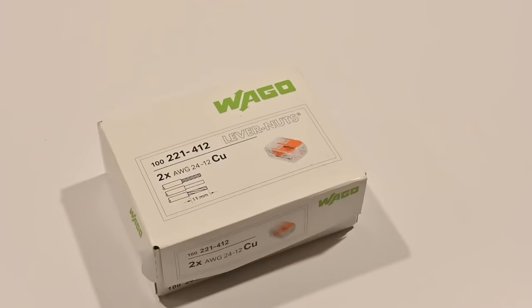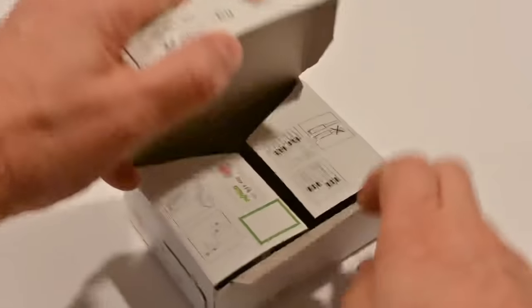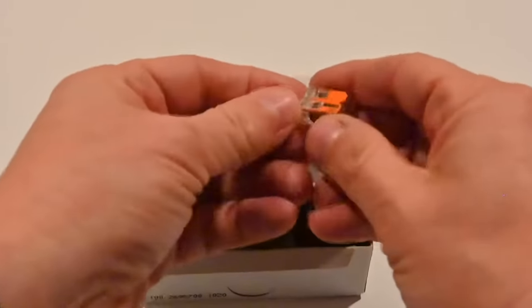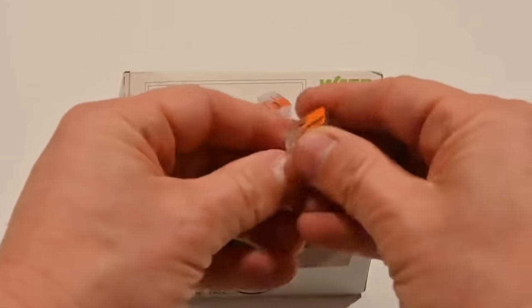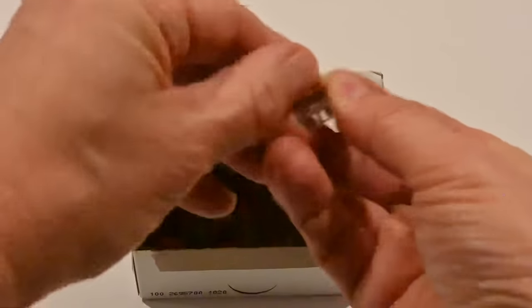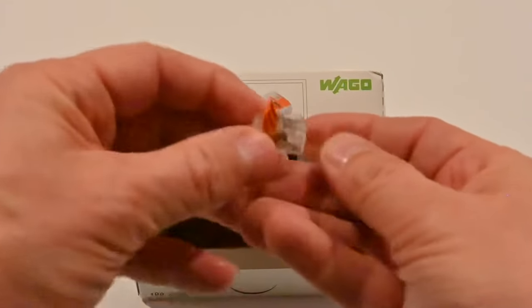Next up, I use another solderless wire connector called a Wago, and the nice thing about these is not only are they solderless, but they can also be used to connect wires of different gauges together. The ones I have here can join wire in the ranges of 12 to 24 AWG, so perfect for my needs. And of course, I'll include a link below.